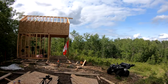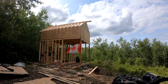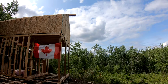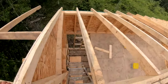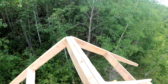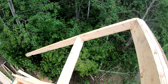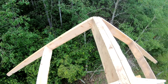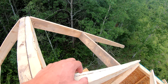What I'm going to start working on now is the roof overhang. You can see I've left two feet on the ridge board on either side out the front and back. Things are looking pretty deadly up here — I'm balancing on my sheet of plywood. I just got started on these overhangs. They're two-foot overhangs, but you've got to subtract that board and that sheet of plywood. So I cut them at 22 and one-eighth inches. I've only put one horizontal board on each one so far.